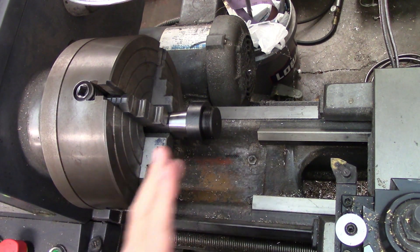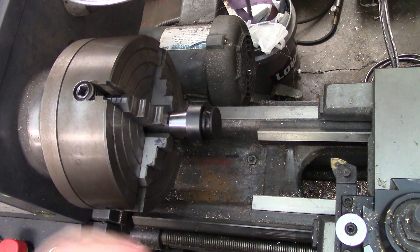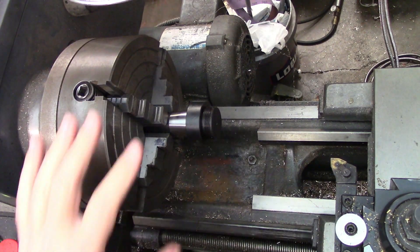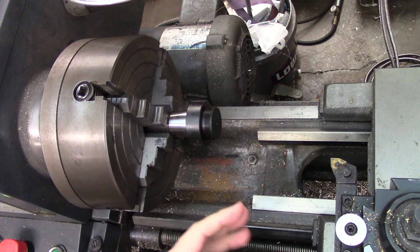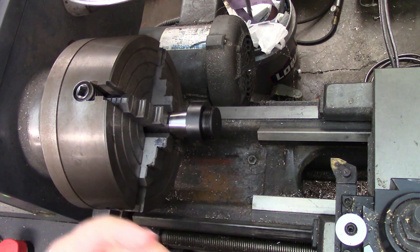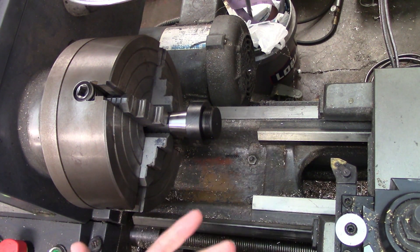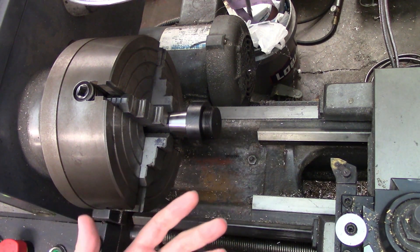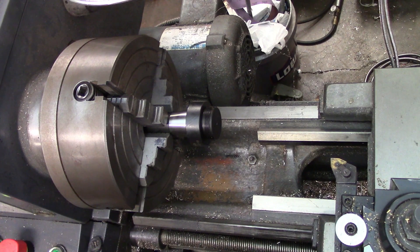This part should be hard — I'm not entirely sure since this is an imported boring head shank. A good way to tell whether it's hard or not is the surface finish. Mild steel or unhardened steel will generally have a torn surface finish depending on the alloy, whereas hardened steels tend to be quite shiny after they're machined.